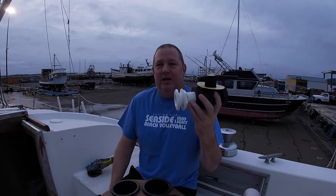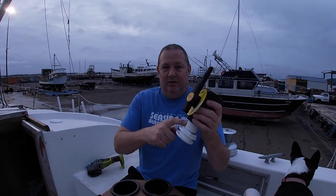This boat I bought — there are rumors it sat for 20 years in the marina. I had no electrolysis on anything that was plastic. Nothing cracked, vibrated, got old, or got brittle. As far as I'm concerned, if it's been sitting for 20 years, that's 20 years of experience. If you use bronze or brass, you're going to need to run a ground wire from every single fitting all the way to a ground somewhere to avoid electrolysis. I didn't want to do that. And even if it's in the water for 20 years, you're probably still going to have to replace the bronze or the brass. Plastic? You don't. My valves, even if they were in there for 20 years, still turned just fine.